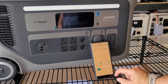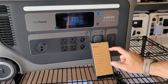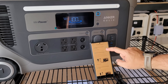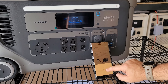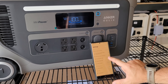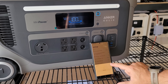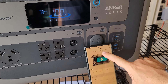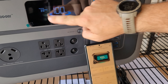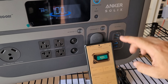If I want to turn off the screen display I can control that right here — I personally like to have mine on all the time. Going into the settings, you can set the battery charging speed and it'll describe how to use the 30 amp port and EV port, and you can select how fast you want it to charge from a 15 amp port. There are some smart modes for energy saving. I like to run device timeout as never, screen brightness as high, and screen timeout at 30 minutes which is the max — I wish there was a never option. One feature I do like is it shows the estimated run time left, which also shows up on the screen, and while charging it shows the estimated charge time until it's back to full.